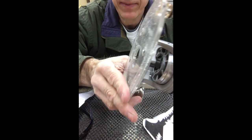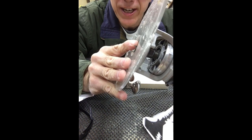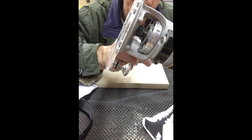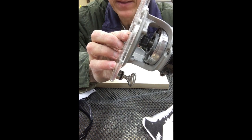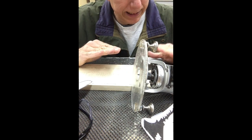So what I'm using, I have the DeWalt DW611, and I've got a 1/8 inch shank 30 degree bit, and I have the Amana reducer to take it from 1/4 to 1/8, and that's what I'm going to use to carve this. This is poplar. This is not pine. I normally carve in pine, but I'm making this out of poplar, and to be honest, I don't think I would try this with pine.